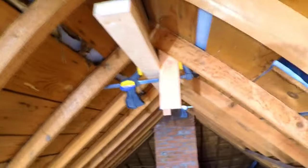All right, so that was a pretty difficult task for one person. As you can see, got this 2.5 inches down from there. That's going to be the same as the top of the 2x4 to there. Kind of got it clamped in with two screws, so that's going to be the ledger board, and this is where I can get 2x4 up from the angle there, connect it up, get all our angles cut and everything, and then just kind of mass produce these pieces, chop all the angles I need on each end of the 2x4s, and then I'll get to securing this together.